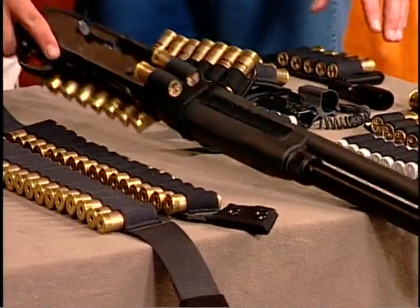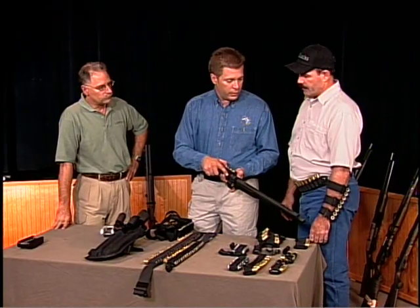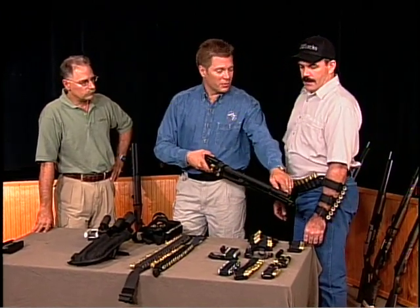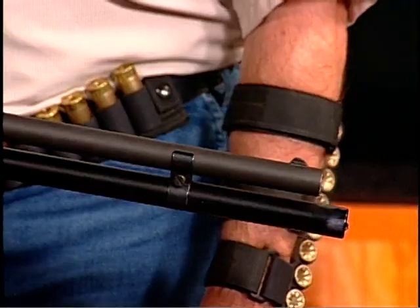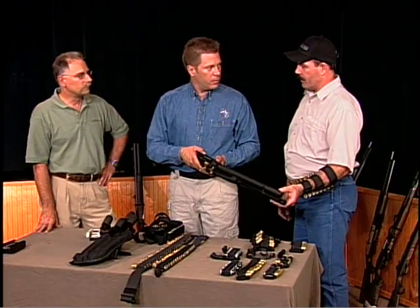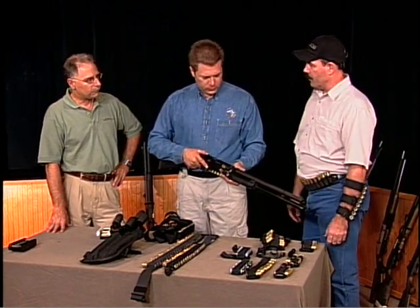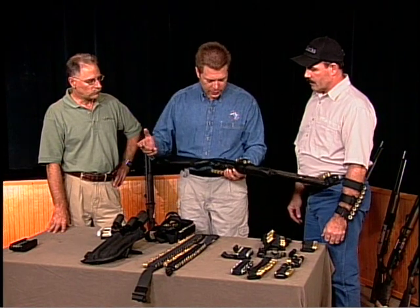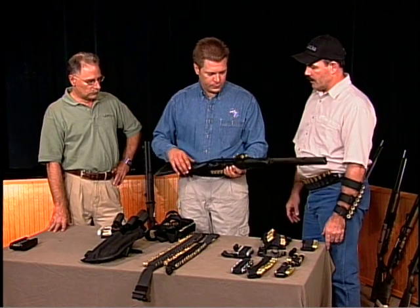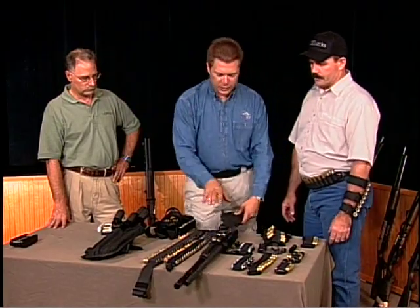On the Benelli, these are a fixed sight, but you can actually adjust for windage on them. Only adjustable for windage. Now, you can, in theory, adjust it for elevation a little bit by doing a little bit of file job on the front sight. Correct. Not that I'm sure anybody's ever done that before. This was actually set up for point of aim, point of impact at 50 yards, so the heights were adjusted by the people that built the barrel for me. And this is a Benelli set up for a limited gun. Correct. No porting, no scope, nothing fancy, just your basic 22-inch, which is not a standard barrel, as we mentioned earlier. So that's the basic setups for those.